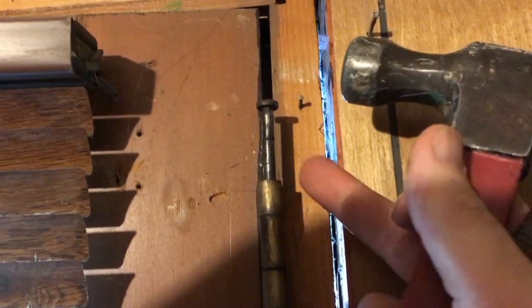Okay, now it's time to go ahead and pull our pins out of our door. We've already taken a hammer and a chisel and freed them up and pushed our pins up here. We've actually got one of them removed. So you should have three pins holding the door in place. Pull all three of them up, and then you can lift the door out of the jamb.